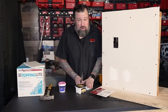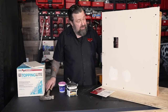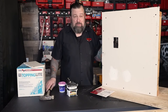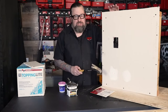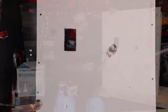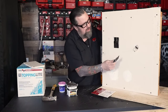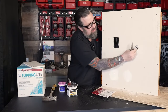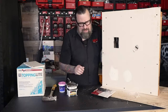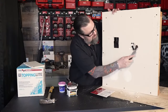When you're dealing with bigger holes, this is where you have those big oops moments. Like this used to be an electrical outlet — that's a bigger project. But the most common is a doorknob hole. I'm going to put a hole in the wall and show you how to patch it. I'll take my knife and clean this up first because the loose stuff is just going to get in the way. Let's make a proper doorknob-sized hole. Now we've got that — clean up the rest of the paper.